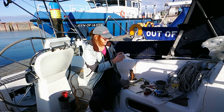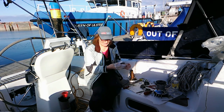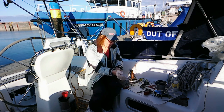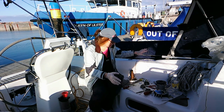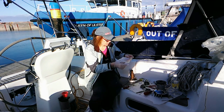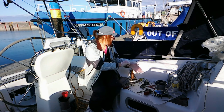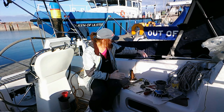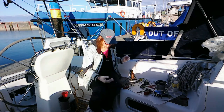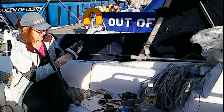The perspective looks a little different because my first camera ran out of charge a few minutes ago. What I've done is I've got my mastic on there. I have Duralac on these bolts — it's a jointing compound which inhibits galvanic corrosion because the threaded block in here is aluminium and these are steel, so when I put them together there could be a possibility of corrosion. And of course I'm just making sure that it does actually spin.